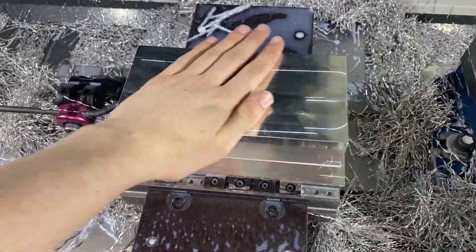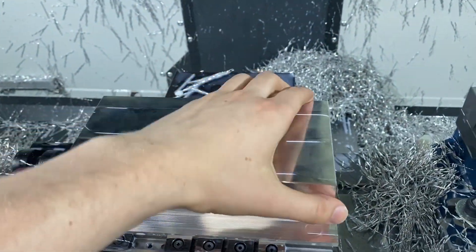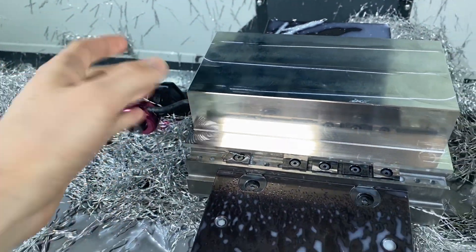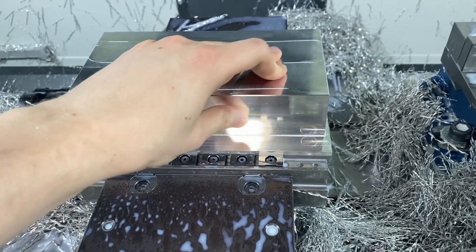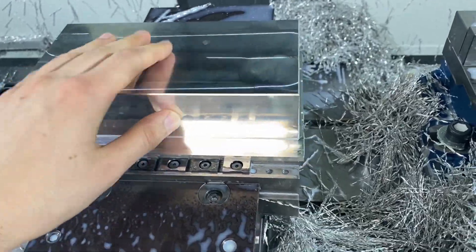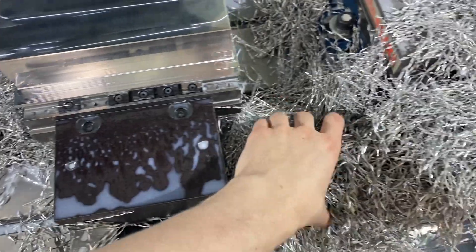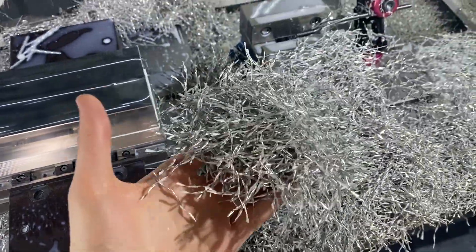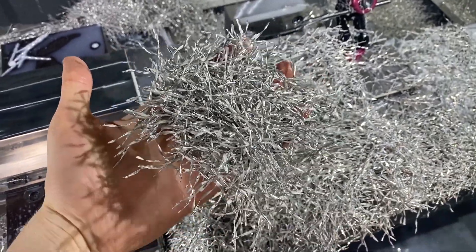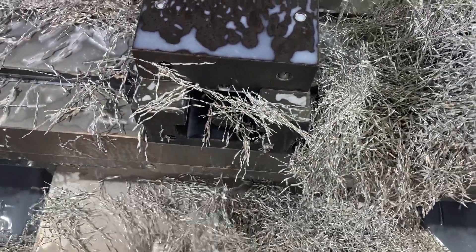Op one is complete and this thing is looking nice — got a nice finish. Not like finish matters on any of this. I have square corners on here. I'm just going to deburr it by hand. It wouldn't take me that long to add chamfers in Fusion, but I like having square corners in Fusion to pick up on as reference, so I'm going to keep that. These chips turned out great — that might be the thumbnail for this video.